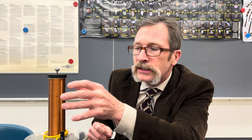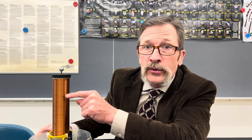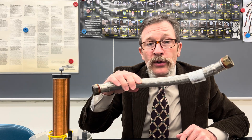This is a coil with magnet wire — it's very thin wire and the insulation isn't as thick, but that's okay because we have many, many winds, and in each wind the voltage difference is not that great. This is a tunable coil, and if I tune it wrong, all kinds of things can happen. You can see there's a little black mark on this coil — voltage probably went too high and broke down the insulation, and electrons were jumping from one loop to the other. That's not something we want.